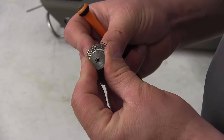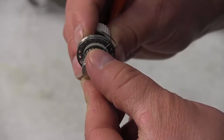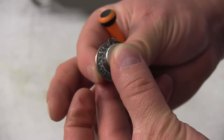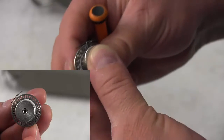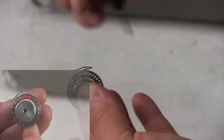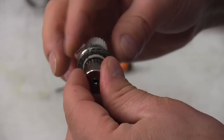Once you've got it slid all the way in, you'll notice at the bottom it's fully bottomed out. With the spring in the groove, twist this clockwise — your right hand or the white knob — clockwise until that spring bumps against the edge of the slot. Count the slots like bicycle spokes or windows on one side of that wheel. Once you've counted, tighten your black screw. That's how you replace the check spring and set the tension.